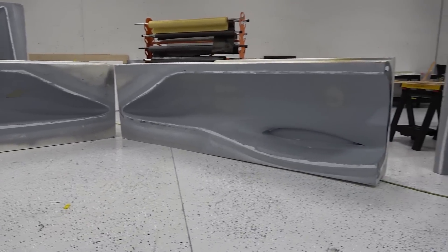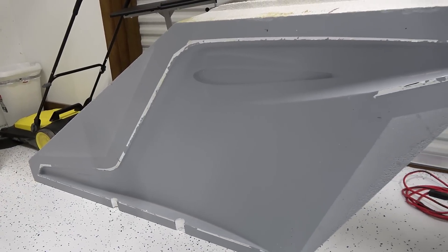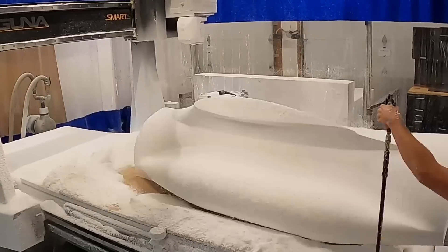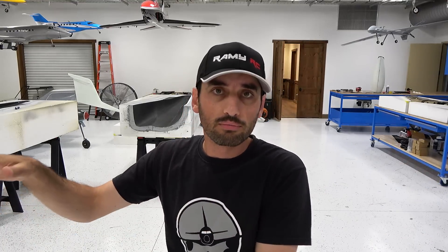But for this one we're sticking with 20 feet. So we made molds for most of it except the wings. We're gonna see how much lighter it's going to be. We know it's gonna be lighter compared between casting carbon fiber and actually machining a whole fuselage. This one's going to be lighter, but the time to finish such a project will be double — between making the molds and casting all this stuff, it's double the time. We got really fast at just machining the fuselage, so we want to see if it's really worth it to make more this way or stick with our method, which is just foam-machining the whole thing.